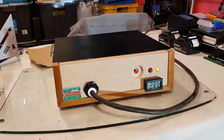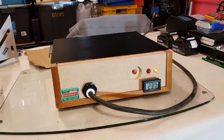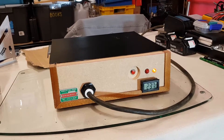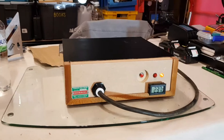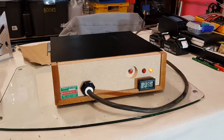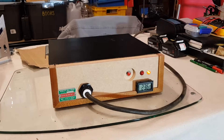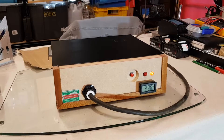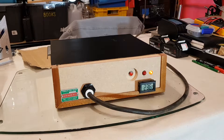By removing the mechanism where you slid the tape in, we now just have direct access to the electromagnet, because that's all these things are — a big AC electromagnet — and that's how they erase the contents of the tape. They're particularly useful for reel-to-reel if you use both two and four track machines, because the tracks aren't the same size and don't align exactly, so a tape recorded on a four track — the erase head can't quite erase everything because the tracks aren't aligned.